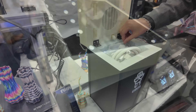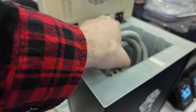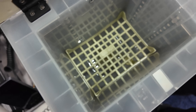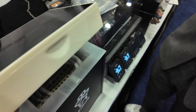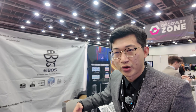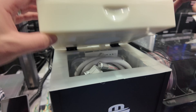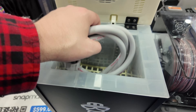This is a resin three-in-one unit that is able to clean, dry, and cure resin parts after you print — just like a laundry machine. You put your print inside, set the time, liquid level, drying time, and curing time from the top panel, click start, and everything's done. It will automatically fill with IPA, and once cleaning is done, automatically drain it and cure it. That's handy because post-processing is one of the worst parts of resin printing, and this makes it much easier.